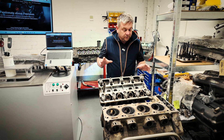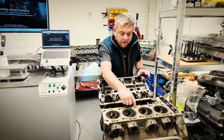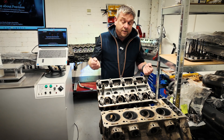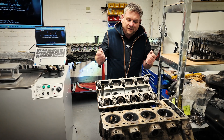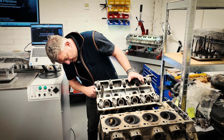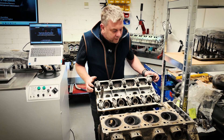Other than that, the cylinder heads are in very good order. One of them you could see where the gasket had been blowing, and it had actually caused some build-up of sediment around the head stud which made it quite difficult to lift the cylinder head off — which is not something you usually see on the V8. The V8 usually has a lot of oil around there and the cylinder head just easily pulls up. This took a struggle between myself and Alistair to get that one off, which was quite strange. Other than that, the cylinder heads are in pretty good condition. Somebody's tried to extract the one-way vacuum valve here and damaged the thread, but we can make an insert and remachine that and make it all back to the way it should be.